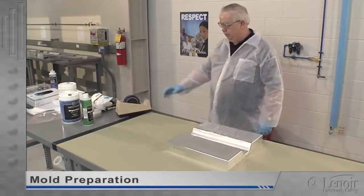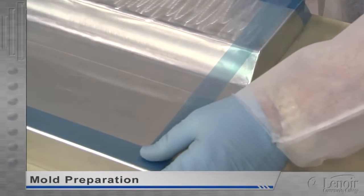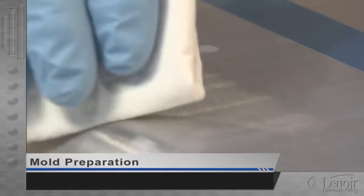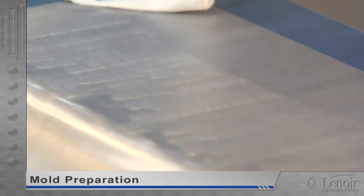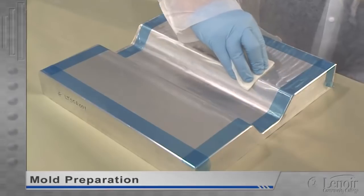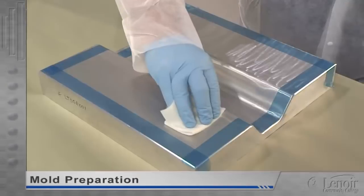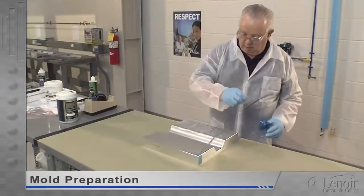Next, the mold is stripped and all test materials are properly discarded. Then the entire mold is cleaned using the same solvent, lint-free wipes, and double wipe method. The clean mold can now be taped off. Flash tape is used to protect a path for the tacky tape that will come later — the tape is run within the border of the mold, away from the part layup area. Next, mold sealer is applied inside the tape only. The work instructions may call for up to four coats of sealer, with oven curing after the final coat. The mold sealer fills in any tiny irregularities in the mold surface, ensuring that the finished part will be as smooth as possible. After the sealer dries, the work instructions may require two coats of a release agent, again only inside the tape. This coating will prevent the part from sticking to the mold. The first coat is applied all in one direction, while the second coat is applied at a 90 degree angle to the first. When the release agent has dried, the flash tape is removed, and this mold is ready for layup.